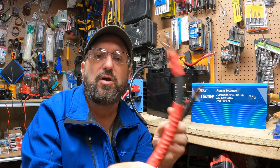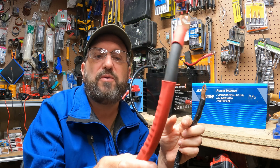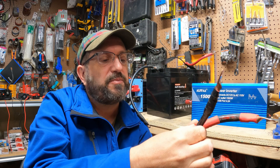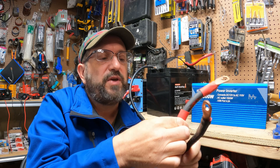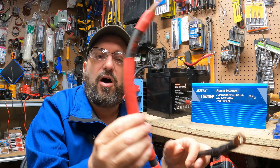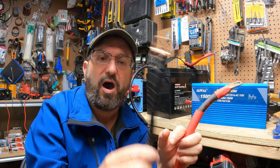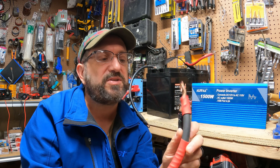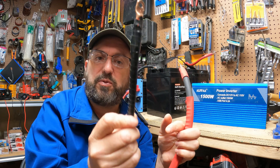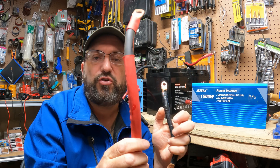You don't want to go with the minimum requirement. Even a properly-sized cable will generate some heat, so going bigger means less heat, less energy loss, and more efficiency. More importantly, it's safer — one of the biggest problems in systems is wires that are too small, get too hot, and can actually cause a fire. Always get something a little bigger than your needs. For our 125-amp system, the 2-gauge would technically work, but I'd recommend the 2-aught that can handle almost 200 amps.